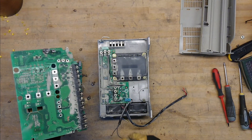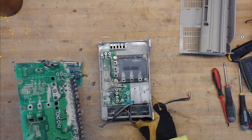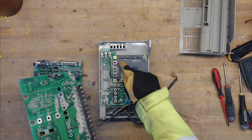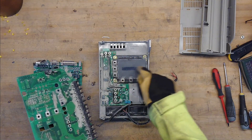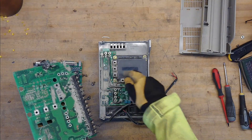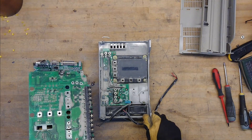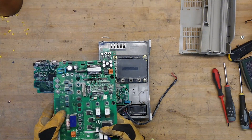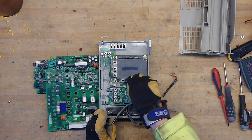With all screws off, it reveals an integrated brick — unreusable. There is no need for this as-is. This is a brick that has a built-in brake chopper, probably some overcurrent control, some measurement, some feedback. There is just no way to repurpose this as it has some control circuitry inside that you also have to drive in order to make it run.